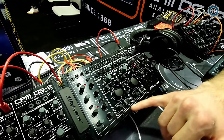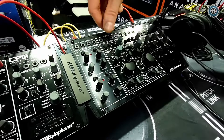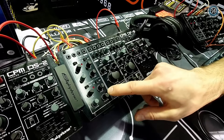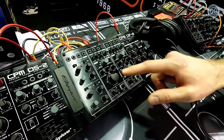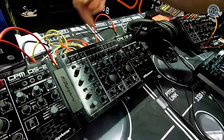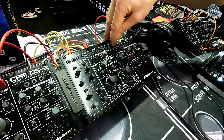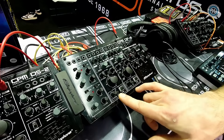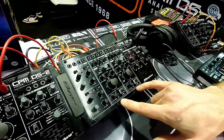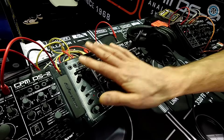There's also a little envelope and gate follower. Depending on your audio in, that determines your threshold level — the higher your threshold, the higher the level — and that can send gates to trigger envelope one to make it play. Or you can route a kick drum into audio in, mute the audio in, send that out here, and use this for a sidechain, so this envelope can essentially be a pumping or ducking sidechain feature depending on how you patch it.